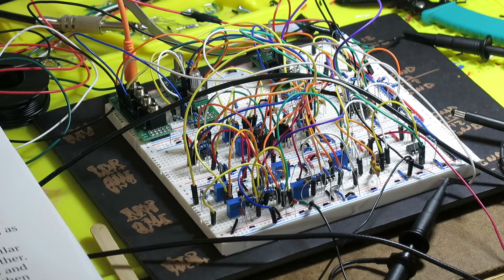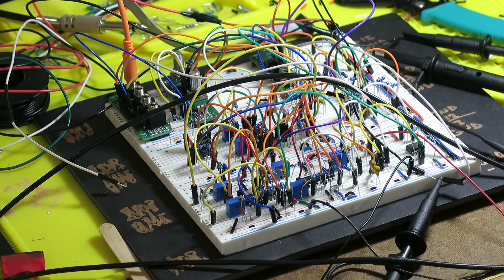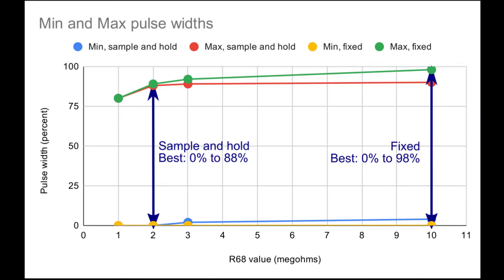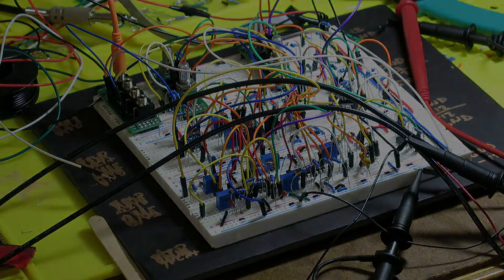Previously on Analog Output: this is an old school ramp core voltage controlled oscillator. The J113 definitely looks a lot better and the triangle output is also looking good. The question was whether to use Wilson's design and settle for zero to 88% or use fixed voltage limits and get zero to 98%. Well, a third possibility was found on the breadboard, and now it's time to build it.